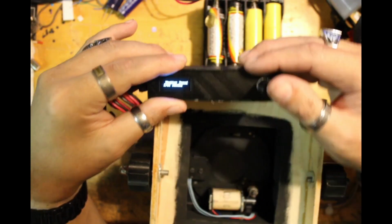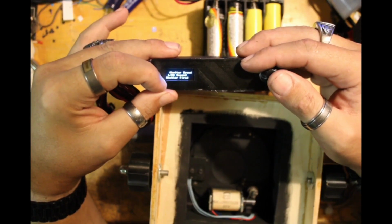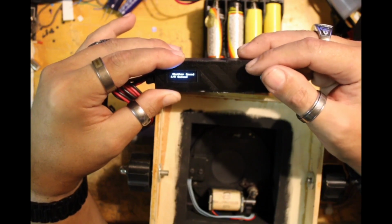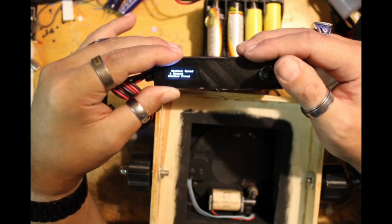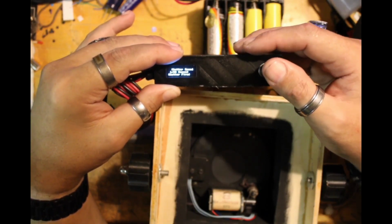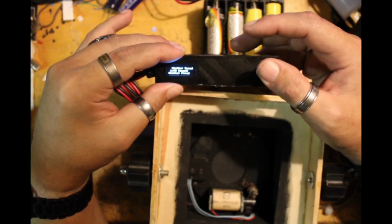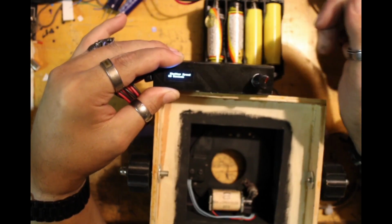But here at 1/30th, it opens and closes, and it has a flag: shutter fired, just in case you missed the click. You can go to 1/15th, 1/8th, 1/4th, 1/2, 1 second. 1/60th is the fastest it can go, and because my camera can only go to 30 frames per second, you don't always see it. Yeah, 30 seconds, and it'll sit there and stay open for 30 seconds.